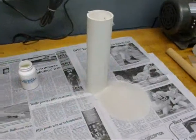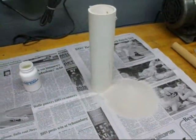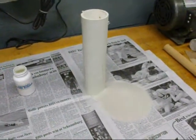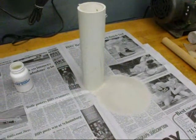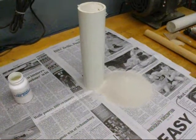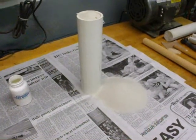All the materials are assembled for the core making. Just one other thing — many other types of sands and formulas or recipes can be used for core making other than the CO2 process. Most often they used to use oatmeal or some kind of cereal and molasses. It sounds like something to eat but that was often used, and you'll find those recipes in old foundry books. The purpose of the oatmeal was that it would burn out after the casting was poured and would provide some collapsibility — that is, it was easy to break the core out.